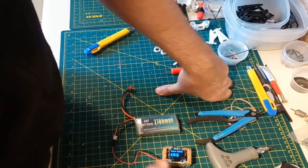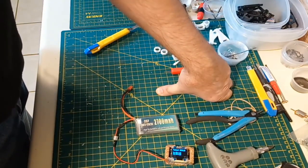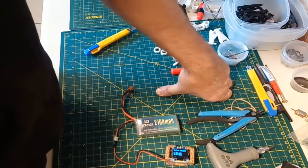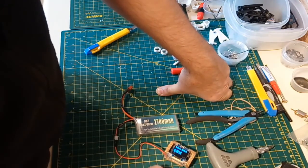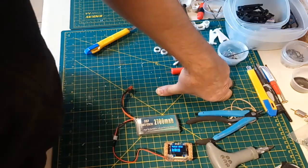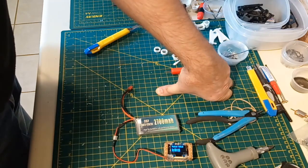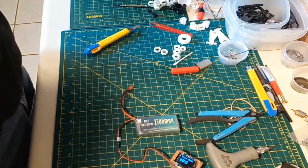You're going to wire it together according to my circuit diagram, then hook it up to your computer. I always start with a simple blink sketch and upload that to the Arduino to make sure it's working - there's nothing worse than thinking it's working when it's not and then poking around forever to find out you didn't do the basics. The blink sketch just makes the LED on the Arduino blink on and off so you can confirm it's working. Once you've got that going, get everything wired up and load the code into the Arduino IDE.